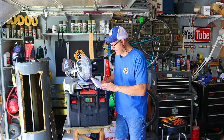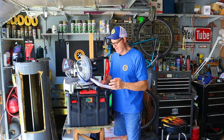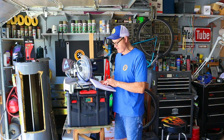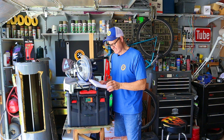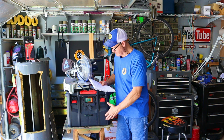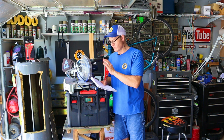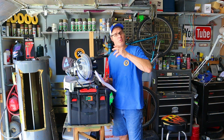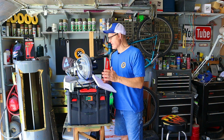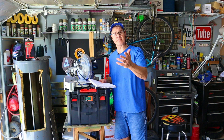Here is the data from the miter saw. I ran this saw non-stop for two straight minutes. My average watt usage was between 560 and 700 watts at the peak. If my average available watt hours is 1300, that means we could run this saw non-stop for just over two hours. If you were out on a job site just making occasional cuts, you could probably run this thing pretty much indefinitely.